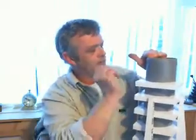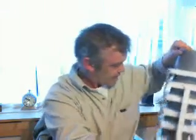Okay, but again, cut those holes using some kind of scorer. If you try to use something like a jigsaw and a drill bit, you'll be at it forever, and it'll take you quite a while with a file and a sander to cut it down. If you do use this, you're going to find it does melt the plastic. It's because of the speed and the... this is a bit old and worn, actually, but it does melt the plastic, and you get some really hard lumps that you've got to remove.